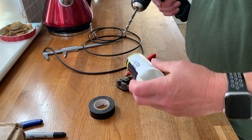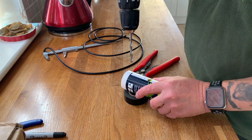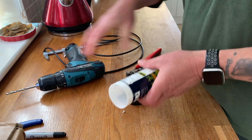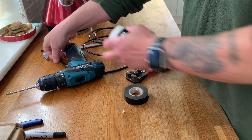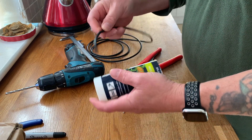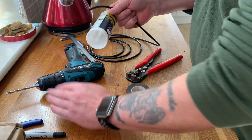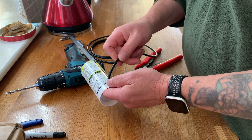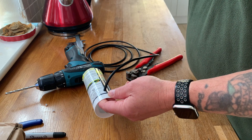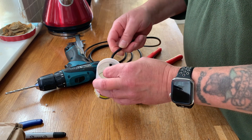First we need a hole. In a time-honored tradition we won't cut our worktop. A very simple hole - let's just make sure that it's the right size. Excellent. Now I've worked it out on the coaxial trap calculator, which I will insert before we do this bit. How many turns I need: it's nine and a half. Just for your information - nine and a half turns.